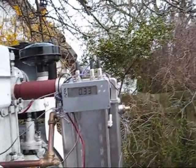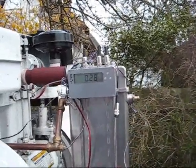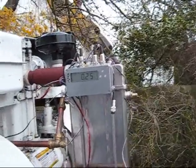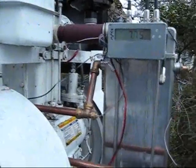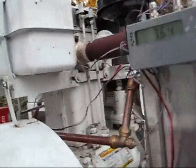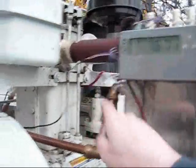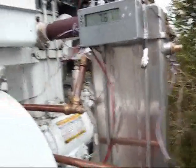This unit measures temperature either side of the radiator, showing exactly how much heat is generated which could be reused in the house. We have around about 8 kilowatts of heat being dumped on the radiator. The exhaust gas heat exchanger is in series with the cooling system, so we've got heat from both the engine and the exhaust — supplying about 8 kilowatts.